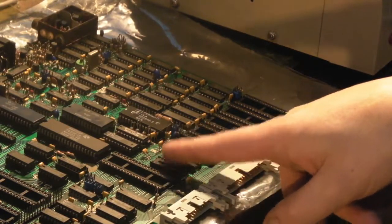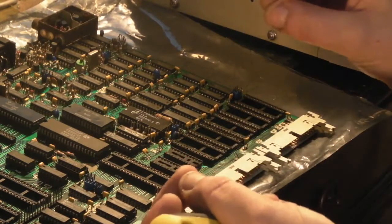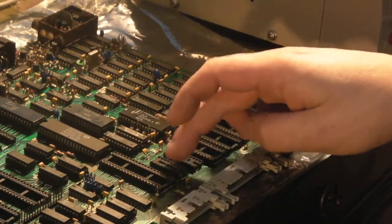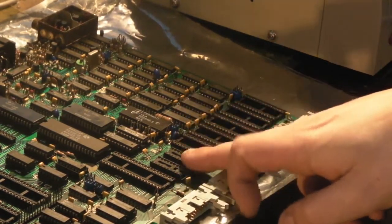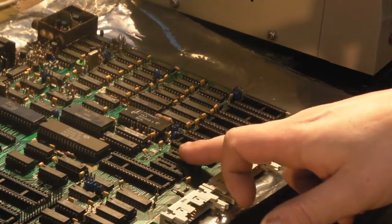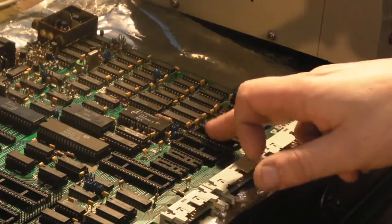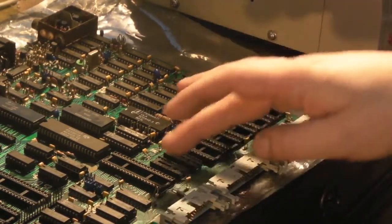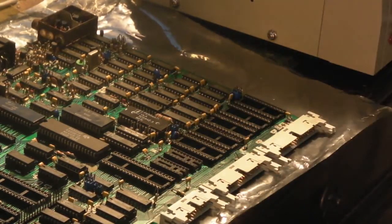I might actually do it on the back. I got a little bit of wire out of an old coil and just bridged it across where the breaks were. I don't know whether that was the best thing to do. It is visible on this side of the board. I'm tempted to get rid of all that. I think there's only three breaks. Trace them out and just do point to point on the back of the board to repair that, rather than the bit of a bodge I did there, and see if I can tidy it up a little bit.